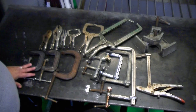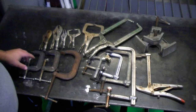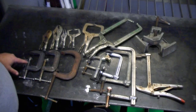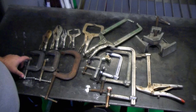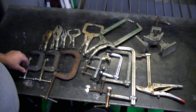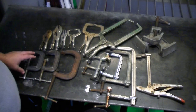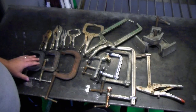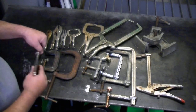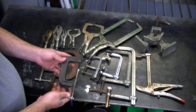I want to start with the C-clamps in particular. These are C-type clamps and you can see they have an acme-type thread that will screw in. This isn't a standard screw-type thread like you have on a bolt — it's got a different pitch and depth and shape of the thread, designed for pressure-type situations. C-clamps range from very cheap to very expensive. What I have here is a very cheap brand clamp.